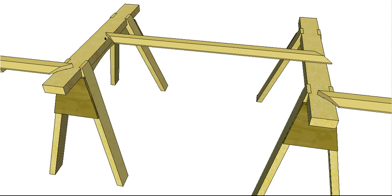So I haven't measured any doors, touched any doorways yet, I've just done that. And you can go around and cut a set of architrave for every door that you need to do. So whether you do one door or 15 doors, you can cut your architraves and make yourself up a set for each door before you actually start.